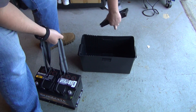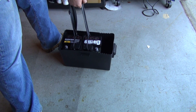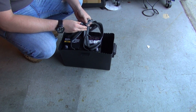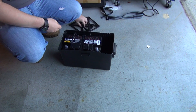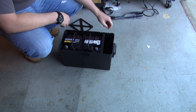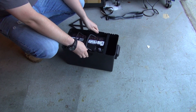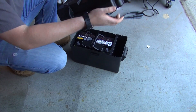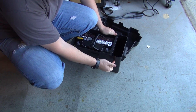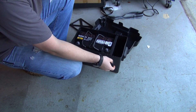Take our battery — we're going to put it on this side away from the notches and put the battery into this box. Scoot it over as far as you can. Take our spacer and slide it in the appropriate spot — there we go, that looks good to me. This way the battery doesn't slosh around. So what's left is we're going to need to figure out where the wiring should be. Since we have this much space here, we're going to drill our hole for our cigarette lighter plug about there — your hole is going to differ based on the size of battery that you have.